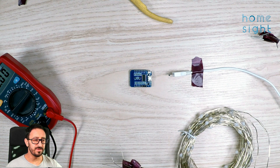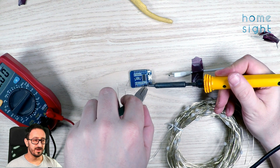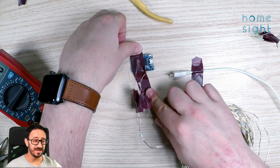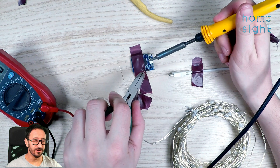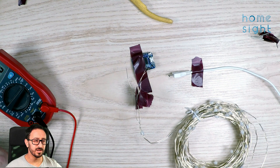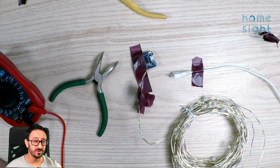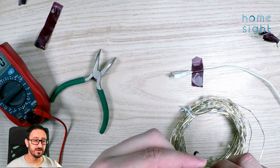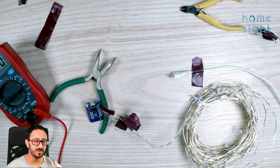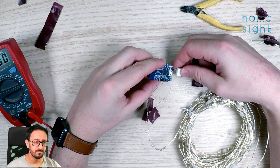I've already tinned the wires themselves. Word of warning: the wires have very, very little insulation and can get really hot really quickly, so I tend to use needle-nosed pliers. It only needs a tiny amount of solder, especially for a little test connection. That first pin was my positive, this is my negative or ground, and the last one is my data pin. The pins are very close together, so make sure there's insulation between them or they're not touching. I'm just checking for any stray wire and giving it a snip. I'm happy and ready to connect.